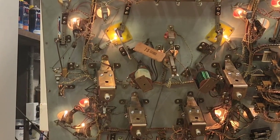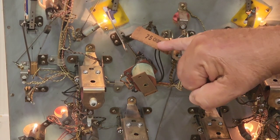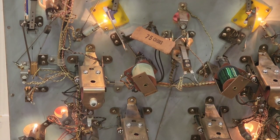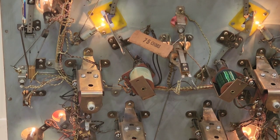One other thing - we have a 75-ohm, 10-watt resistor just came into view there. I've checked that to make sure it's okay because they get quite old. This is running off the 25-volt circuit. They use a number 44 lamp in the 25-volt circuit, using the resistor to bring the current down, and you'll only replace those lamps with a number 44. If you put a 47 in it will glow very brightly, even supernova, and probably blow after a fairly short time.